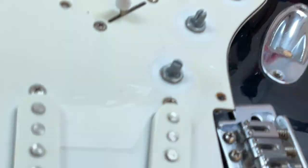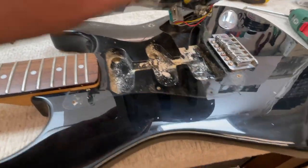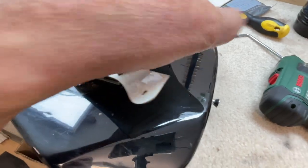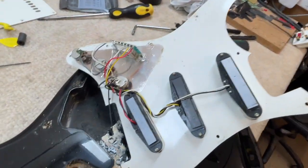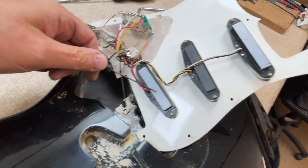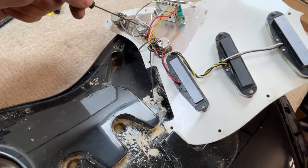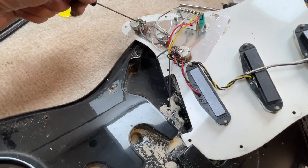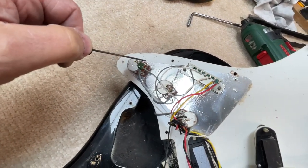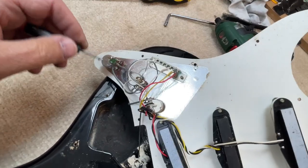So underneath your guitar hood lives, I don't know if we've got enough cable to turn this over. Right, here we go. Under there lives some components. Your three pickups: your neck pickup, middle pickup, bridge pickup. You've got your five-way switch, a volume control, and a first tone control and second tone control. And there's a capacitor, that green thing there, which is what makes the tone controls bleed off the trebly sounds and make it sound a bit bassier.